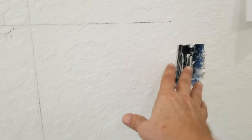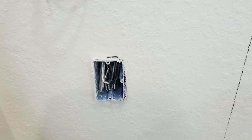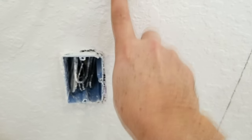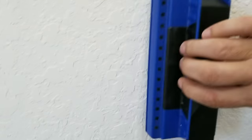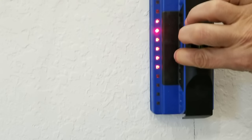One thing to remember when you're looking at the walls: you've got outlets here, here, and here. We don't really care about where the studs are because we put all the cabinet blocking up — wherever we put a screw we're going to hit a stud or a block. But there's always going to be a stud next to an outlet box, so that'll help you find them. Here's our stud finder tool that we use.